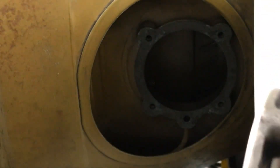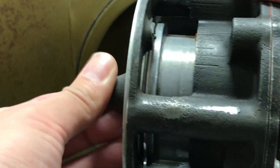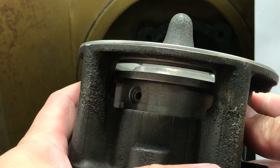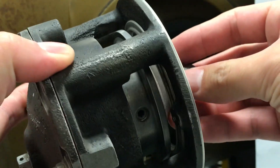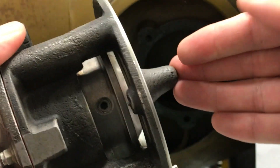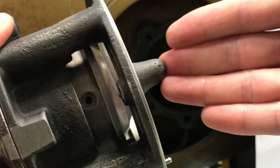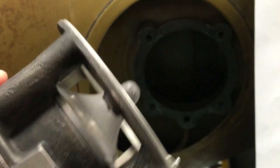The modified P3 pressure will close the valve. And when compressor pressure builds up, the pressure inside of here, which is P2.5 — if there's too much pressure inside here, it's gonna push the valve to the open position like this, to release the pressure inside the compressor.